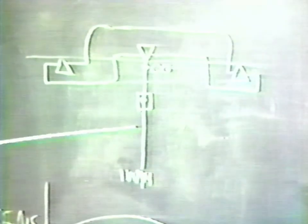Secondly, the system becomes very stable because the temperature effects are extremely minimized. Now, when we use a magnification of this angle that is being measured, it is necessary that the rest of the balance be very properly constructed. That is, the knife edges and the bearings become a very important function in the precision of the system.